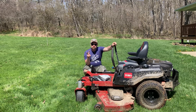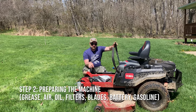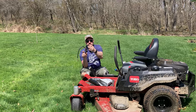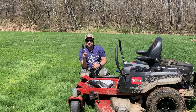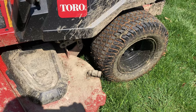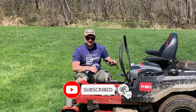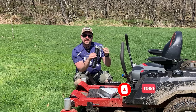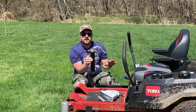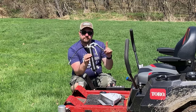Important step number two. First is preparing your yard; next is preparing the machine. With the Toro Time Cutter, a couple of things I want to do. First, I want to check all the air pressure. I use this Astro AI air gauge — it tells me what the air pressure is and I can slowly hit the trigger to inflate and get my tires to the correct pressure. It'll say either in the instruction manual or on the tires what pressure they should be. It's important to get them to the right pressure so that your mowing is even. You also want to grease any grease points. This Toro Time Cutter has sealed bearings on the mower deck, so there are no grease points for me, but if I were mowing with the John Deere, I'd use my grease gun to grease all those Zerks and make sure everything's properly lubed up before the first mow of the season.